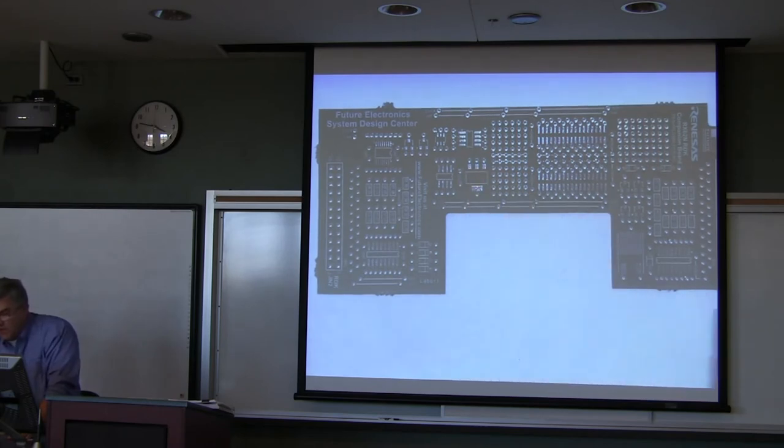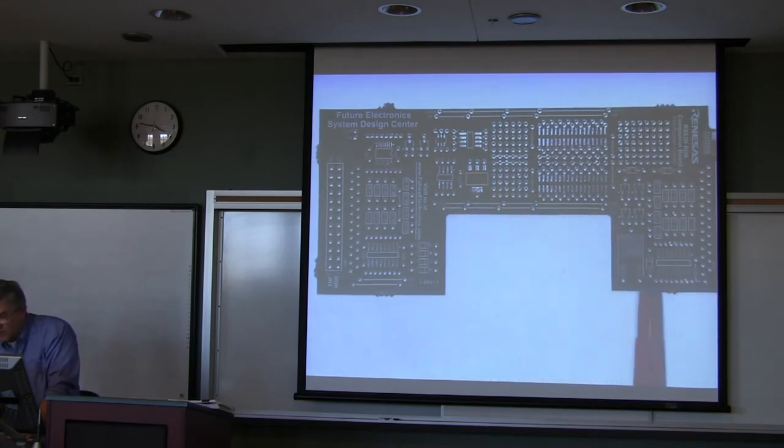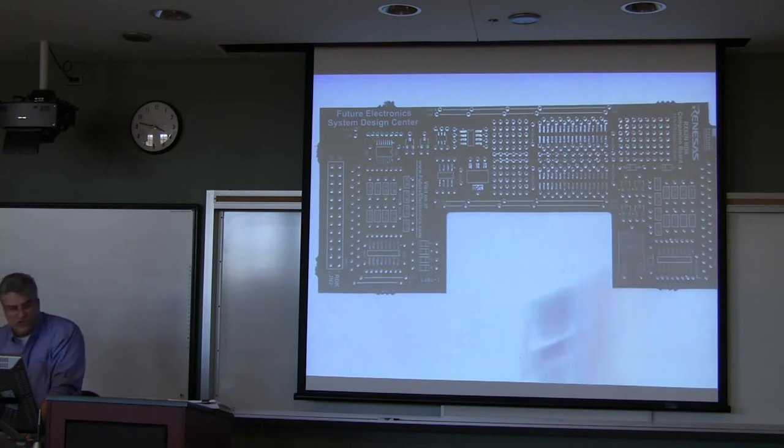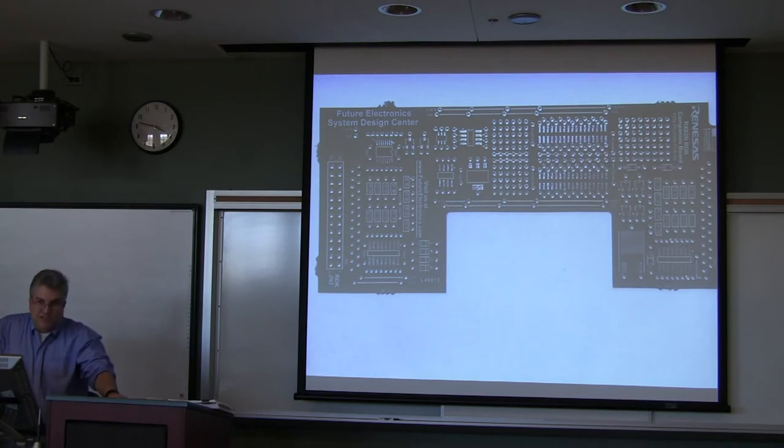for the chip. You also have this up here. What do you think this is for? Give you a hint. There's this big old slug there. What do you typically need something big, huge piece of metal for? Heat sinking. So that's going to be something that has a heat sink, which is typically what? Transistor. Some sort of transistor, right? Whatever fits in that with 2 pins. One end, one pin at the other end.